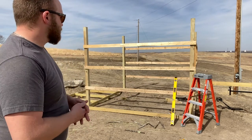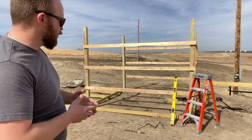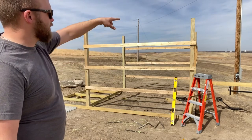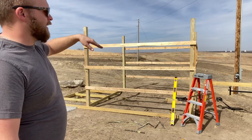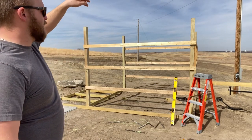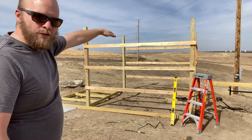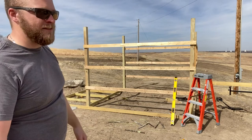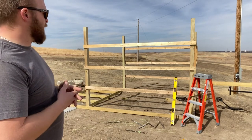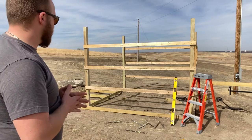It's just the market's that way right now. My plan is, since I had to drop my 4x4s down into the 2x4s three and a half inches to get the support I needed to my anchors, I've got basically seven foot six from the top of the bottom 2x4 up to the top. So seven foot six in the front and seven foot in the rear, and that'll give me six inches of drop for the watershed. So basically from the front, seven foot six, and on the back side of the chicken run will be six foot — that's a foot and a half, basically 18 inches of waterfall shedding into water buckets to water the chickens and garden.